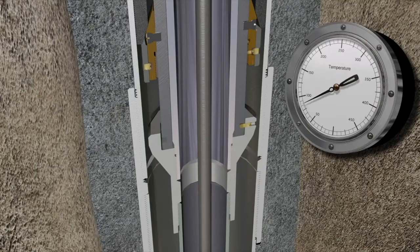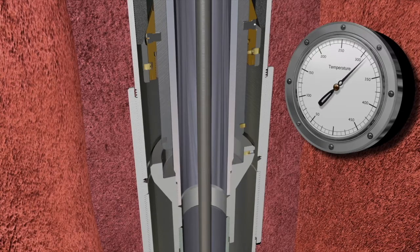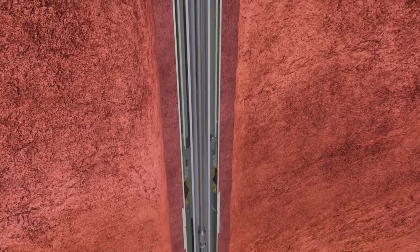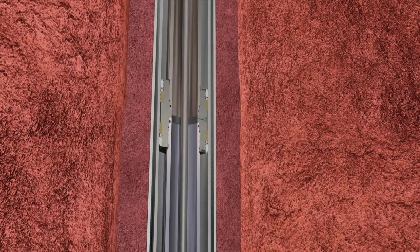That is why Tejas developed a tubing anchor that compensates for large fluctuations in thermal conditions. The compensation part of the tubing anchor is basically an expansion joint, allowing it to move axially but limiting lateral movement and preventing tubing buckling. At the same time, the hydraulic shock absorber resists tubing movement and dampens axial movement as the pump reciprocates up and down.